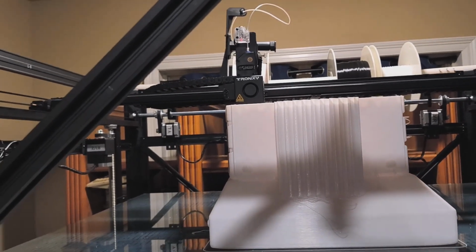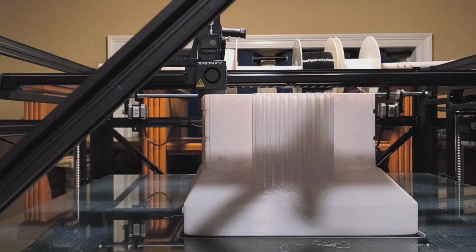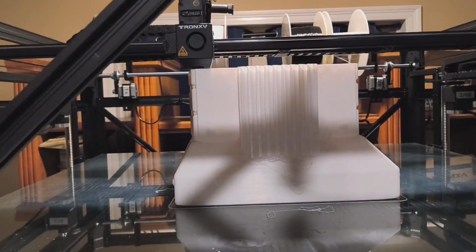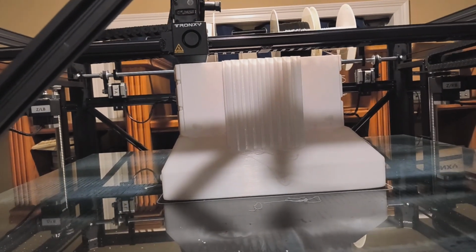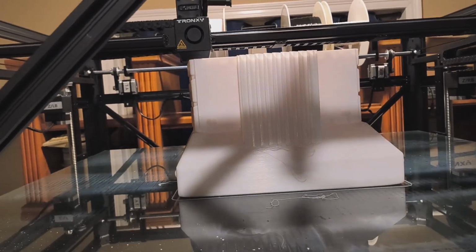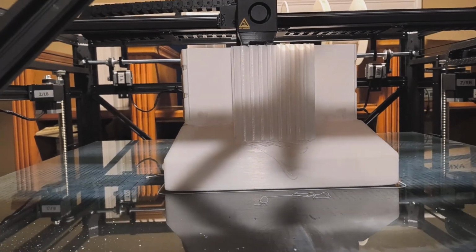Stopped for a third time. Same thing, abnormal feed. Now it's going again, and of course I trust this thing as far as I could throw it now. So I slowed the print back down to 100%. I've also cranked my air conditioning up a bit just in case the filament was just warm and expanding, or anything that could possibly be affecting it.